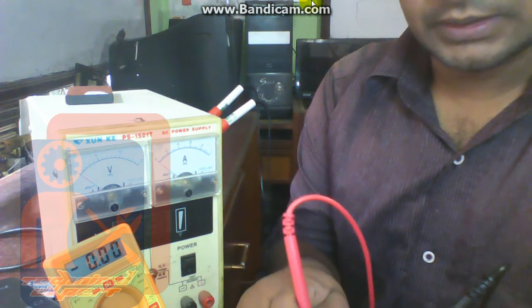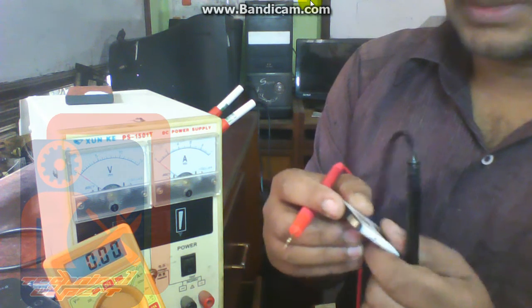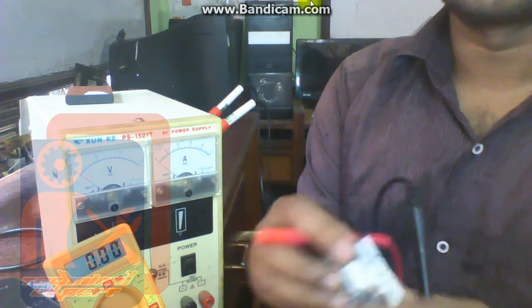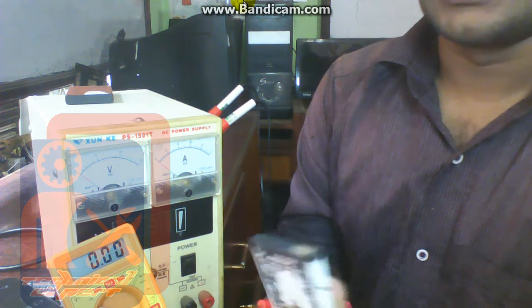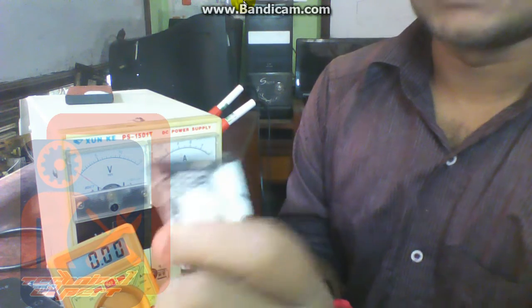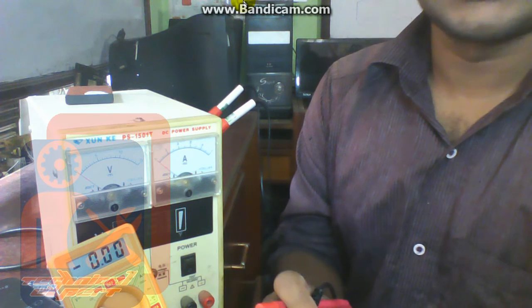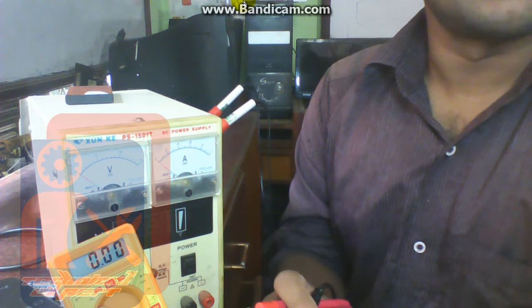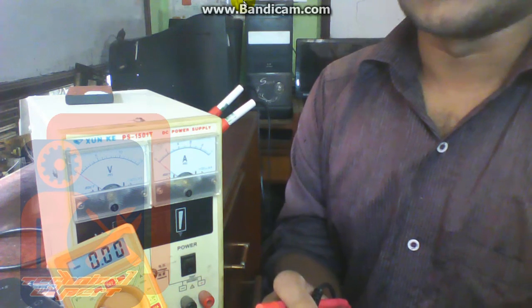It's 0 volt. It means this battery is not going to work. It has 0 volt. So if you want to repair this battery, if you want to make this battery work, then you have to charge it up to 3.7 volt. But by a normal charger, by putting it into the cell phone and using a normal charger, its voltage is not going to increase, because if the voltage of a battery is less than 2.75, then it is not going to charge.